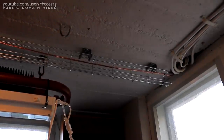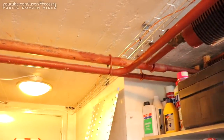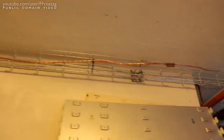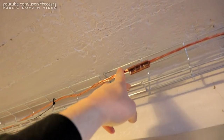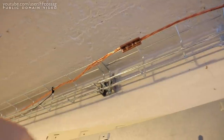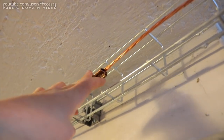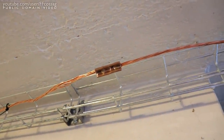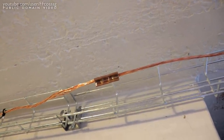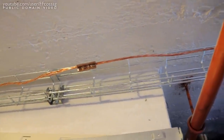Downstairs we have our rail painted all the way that it needs to go, and the new potential equalization cable running. This cable keeps on going out through the wall and into the ground, and I needed to extend it. So I found some 15mm copper pipe and a big crimp tool, and just crimped this copper wire with a copper tube - and that's on there very, very well. Crimping this was very difficult but it's not going to go anywhere. The first time around I just had a couple of hose clamps and was going to solder it, but this crimp is a much neater solution.